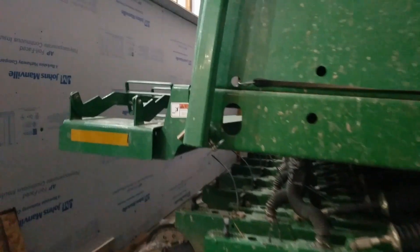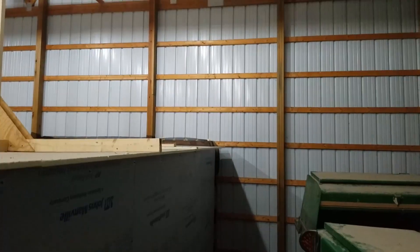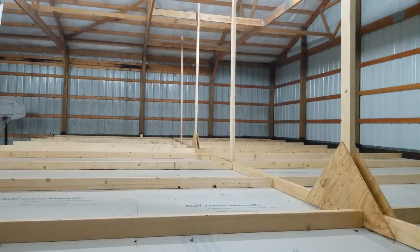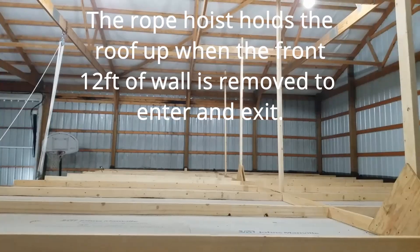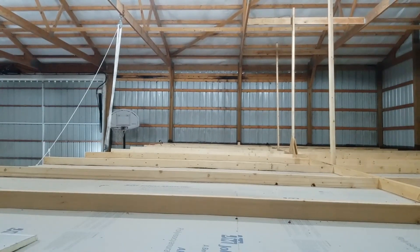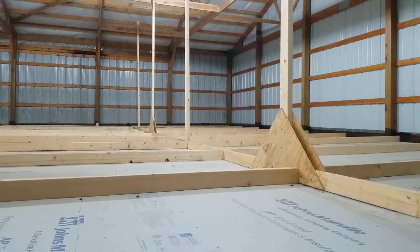I'll show you the top side — it's very simple. We just dropped four boards down from the rafters to hold the ceiling up. We've got 12-foot two-by-fours run to the center board, which is attached to the uprights, and then every four feet we ran two-by-fours crossways and attached to that. It's just a temporary building, but I wanted one good enough I could heat and cool it, and it has worked very well for that.